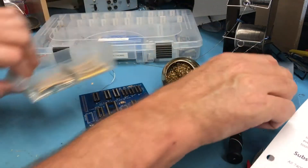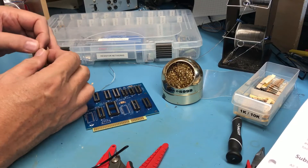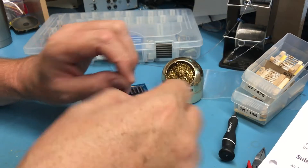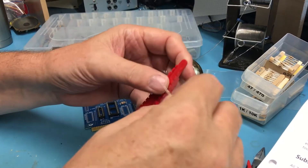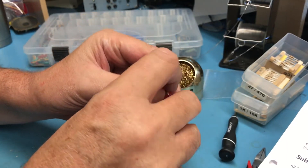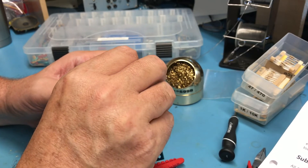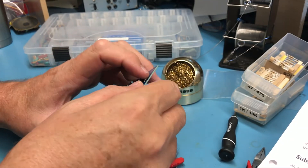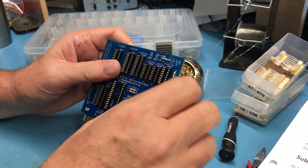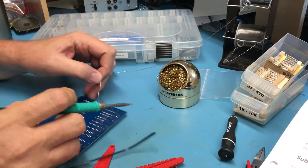That's the wrong box. Yeah, this always gets to be fun with different re-spins of the board having differences — which is of course why you re-spin a board. There's a 470-ohm here. This one is 470 ohms for feeding an external LED, and the one up here is for feeding the onboard LED — actually for current limiting to the LEDs, I should say.